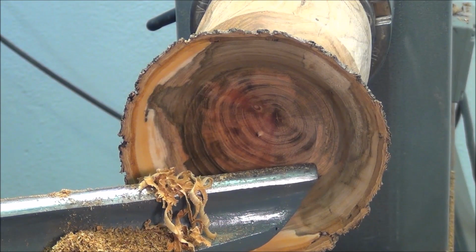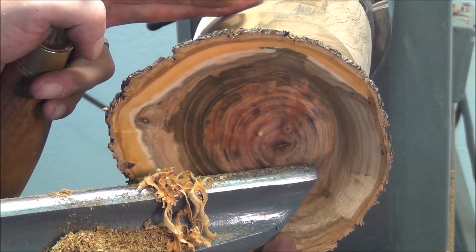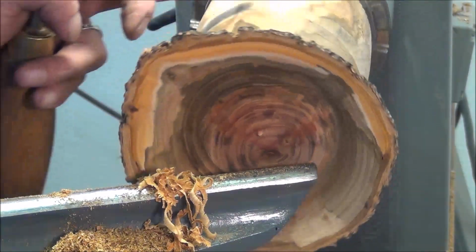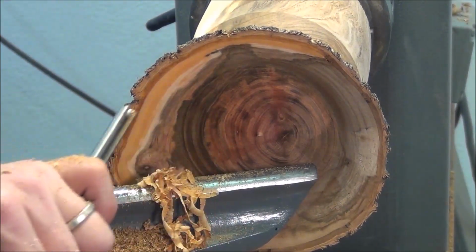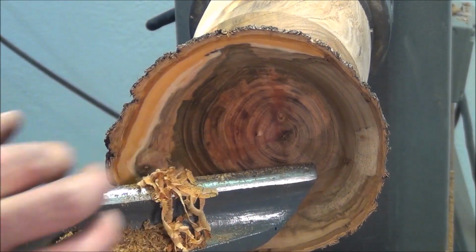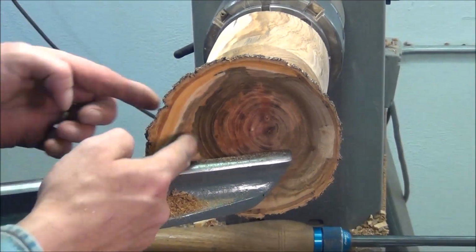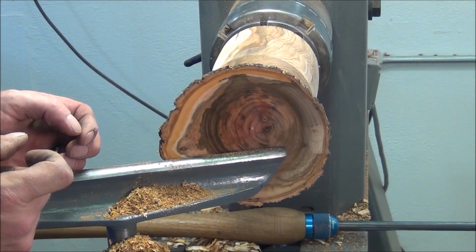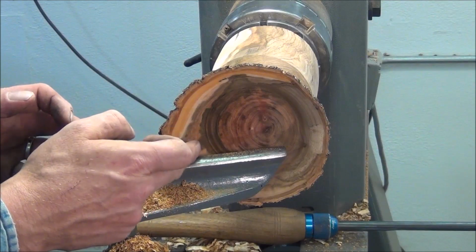Okay, there we'll go. Be careful, turn the piece around. Be careful the underside of the tool rest doesn't catch on the piece itself and destroy what you've done. So that's got that a lot closer. Nice even wall thickness here. I'm going to do one last thing before we go any further to finish that ready for sanding, as I'm going to use the wing of a spindle gouge right on its edge, and we're going to shear scrape that. It's end grain.